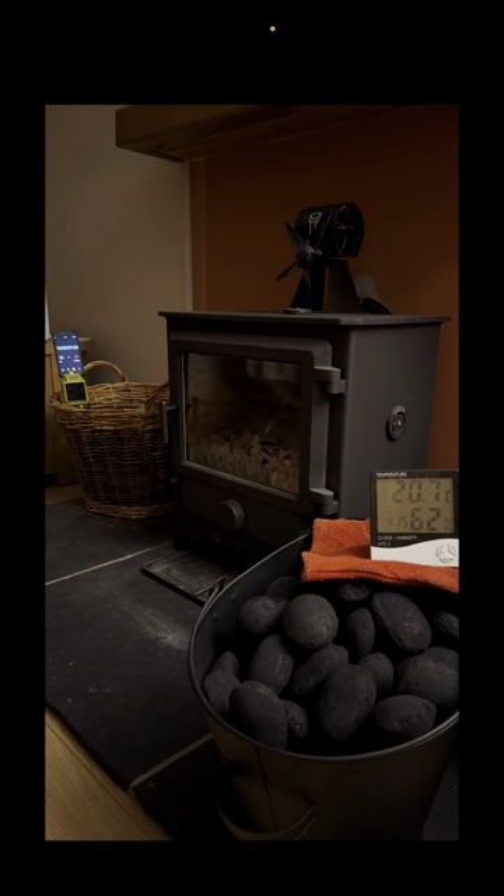This is what the stove looks like near the 14-hour mark. There was actually some slight glowing embers in the corners, far left and far right. I was trying to get a reading off the top — it's about 43 degrees at the flue and 38 degrees at the front. The front of the glass was about 50 degrees. So 14 hours in, we're still fairly warm. If this was wood, this would have been cool long ago. The side is reading about 54 degrees.